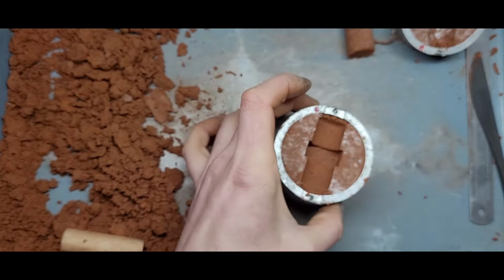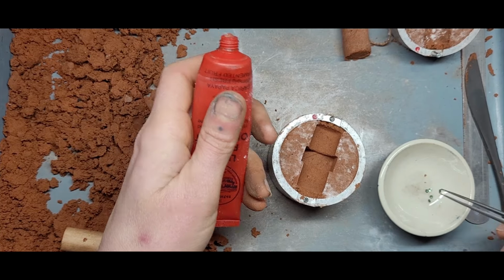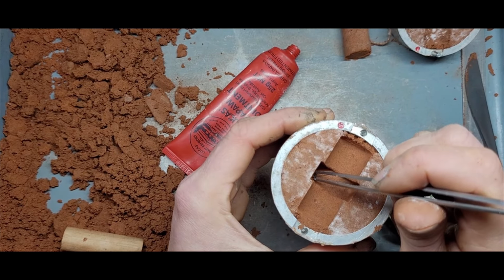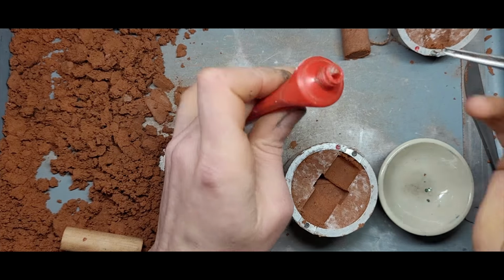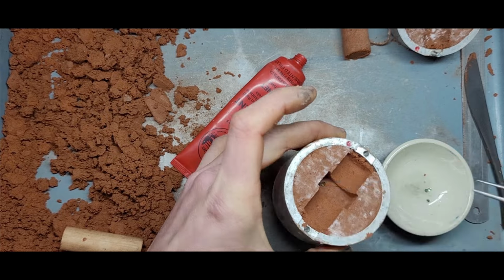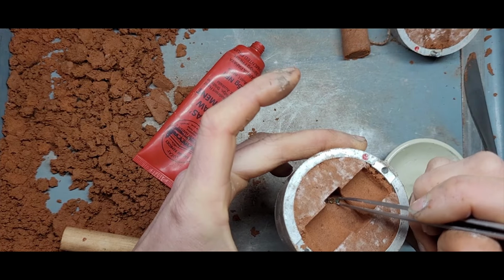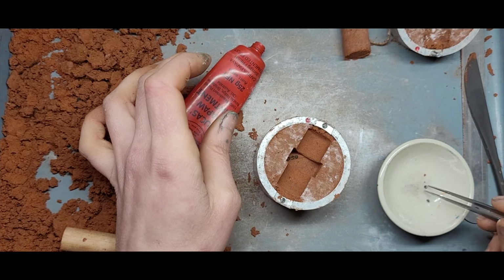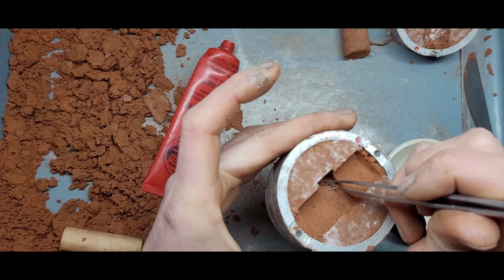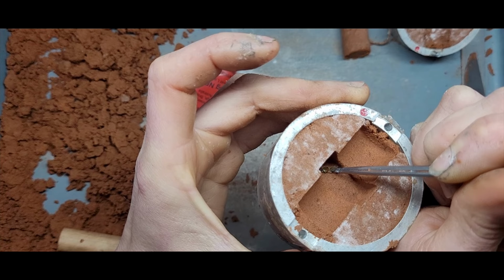That's where I'm going to put my channel set stones, and I've got some pawpaw ointment here to help adhere them down. You don't have to use pawpaw ointment, you can use any petroleum jelly based product. So let's stick that down. Now I'm just going to really lightly place them down at the moment, and I'm going to go back in afterwards and just make sure that they're all in the correct position, and then I'm going to give them a little tiny press on their bums, and that's just to make sure that the table of the stones are in very good contact. We're going to create like a seal between the clay and the pawpaw ointment and the table of the stone. So at the moment, before it's completely stuck down, I can very, very easily move them.